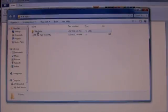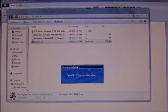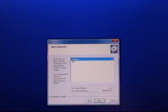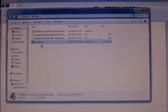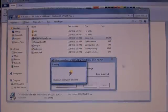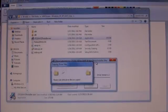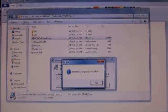Here's the folder I created earlier. We'll click on the unzipped file and click on T6Configure.exe — allow it to install on your computer. After installing the T6 software, we'll go to the USB drivers and install the driver for the USB programming dongle: the Silicon Laboratories CP210X USB to UART Bridge Driver Installer. Installation completed successfully. Brilliant.